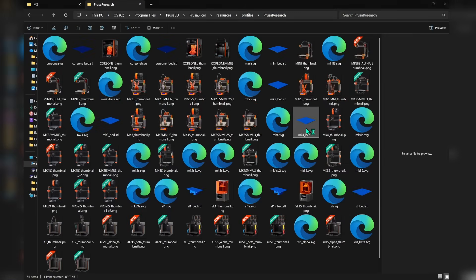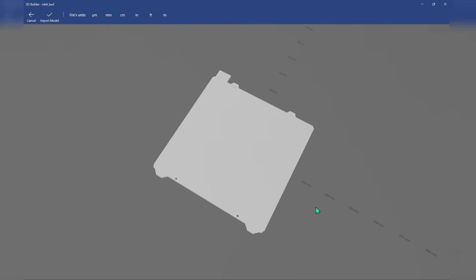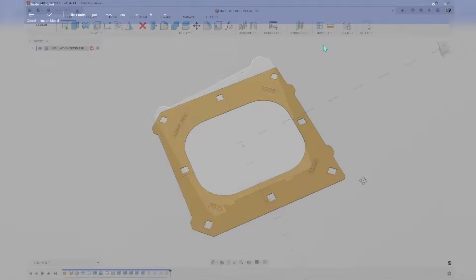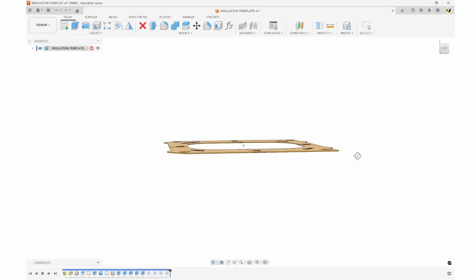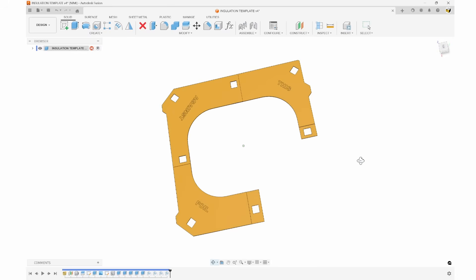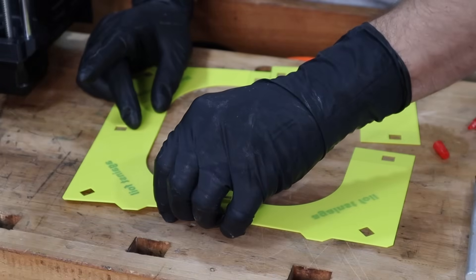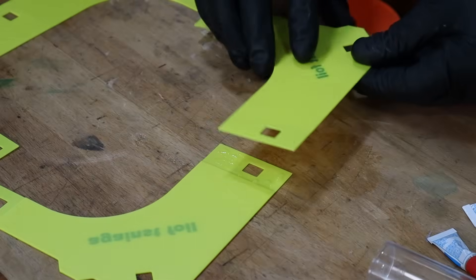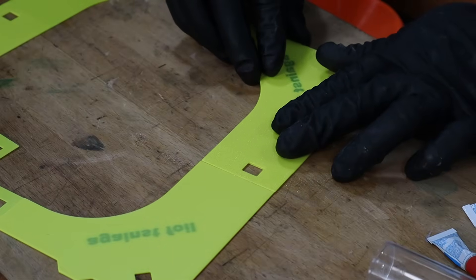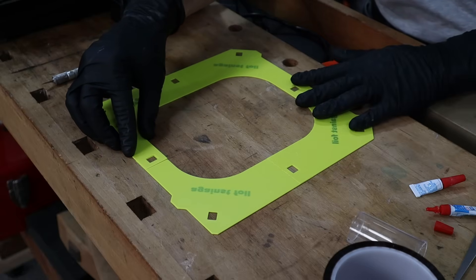I think we can work on one more adjustment to get more even bed temperature across the entire bed. I used the STL file from the bed in Prusa Slicer, made sure it matched the printer bed — it didn't, so I had to make a few changes — and added hole positions. The holes are not evenly spaced, which was interesting. I hollowed out the center area based on the heat patterns we were seeing: cooler on the sides, hot in the center, and a little cool front and back. I designed it with overlapping pieces split into four so it can be printed on the Mark IV S.